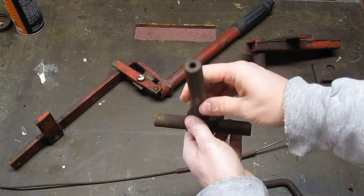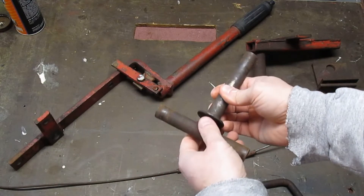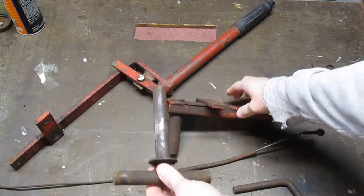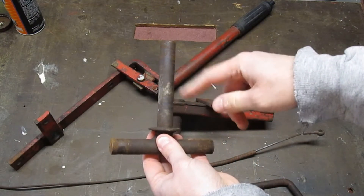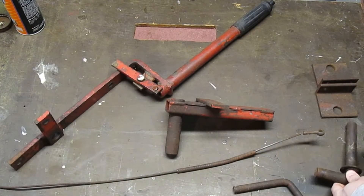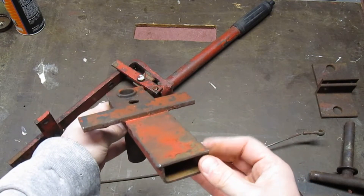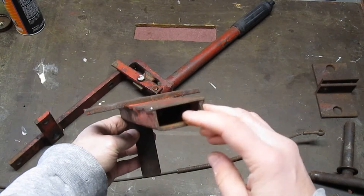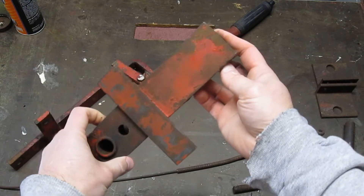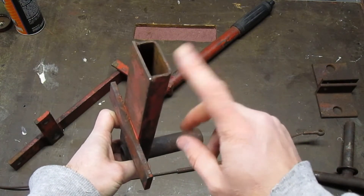These parts are pretty easy to remake. This particular rear hitch I bought off a 1957 tractor — my tractor is a 1956, but this is actually a 57 hitch. These frame mount pieces are usually really rotted up or frozen to the hitch, so you really have to beat them to get apart. We know this is a 57 hitch by way of all sheet metal construction in the implement slot area — 55s and 56s were made out of band iron. The 56 was kind of a blend year: some were all band iron, some were sheet metal.